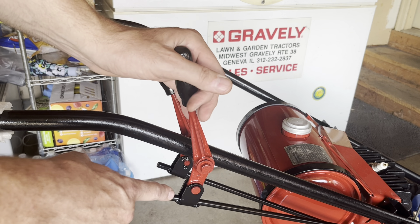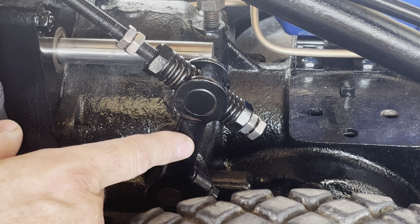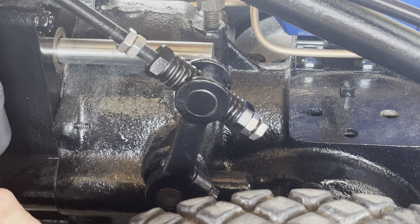Let's adjust the high-low clutch first. What you want to do is adjust these jam nuts so that when you move your lever and it pulls this rod, it pulls the clutch all the way in, and then the jam nut catches and creates enough tension that it cams over your handle and locks it into place. This one actually seems like it's pretty good right now. You want it to snap over nice and firm — you don't want it really loose to where it'll vibrate out, and you don't want it snapping in so hard that you put too much pressure and end up breaking or bending the rod. Just a nice firm snap into place.